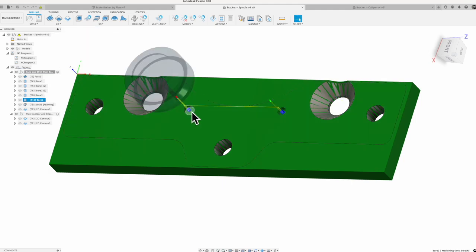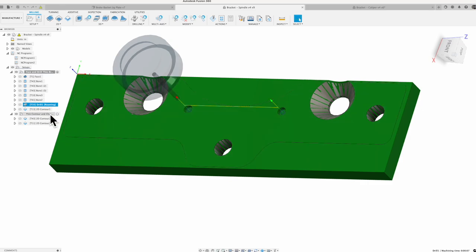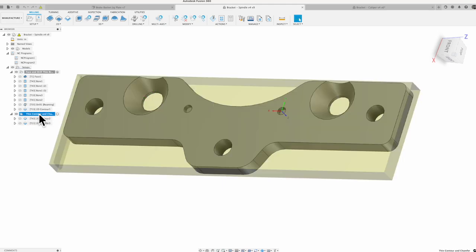After that, change over to a 1/8 tool bit, put a quick 1/4 inch bore in the holes in there, and then I'm going to finish those out with a 1/4 inch reamer. That's going to be for our dowel pins to align this when we flip it over. And then just quickly put a little bevel on the top side of those holes. Then we're going to flip it over to the back side.